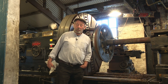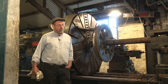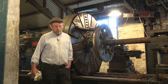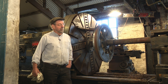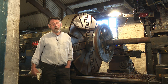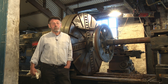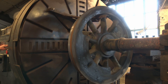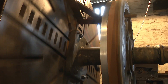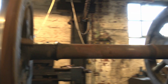This wheel lathe we acquired from Consett Steel — Consett Iron Company really — back in 1980. We're very fortunate to have been able to acquire it; it's enabled us to do a vast amount of wheel turning ourselves and saved us an absolute fortune, as well as letting us learn the skills of wheel turning. Just like car tyres, railway tyres wear down so they need to be reprofiled, and that's what this machine does. It also turns journals, which is the bearing surface for the locomotive.